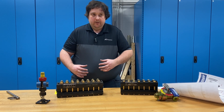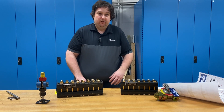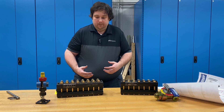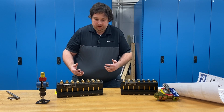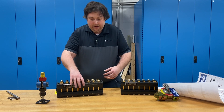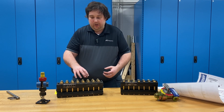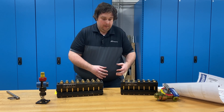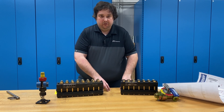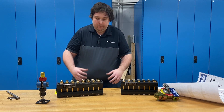It's important to note that re-torquing at receipt is different than hot torquing. In hot applications, you want to install the gauge, get it up to temperature, then isolate the gauge and drain it per your site requirements, and then re-torque the bolts at that time. At high temperatures, things can relax and expand, so it's very important to re-torque the bolting at operating temperature. So if you have a hot application: re-torque it first when you receive it, then install, commission, then hot torque it, and you're in the best position to go forward.